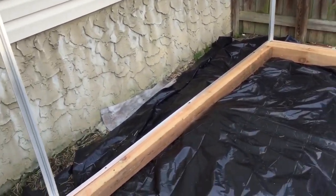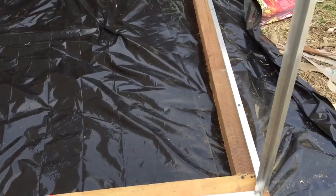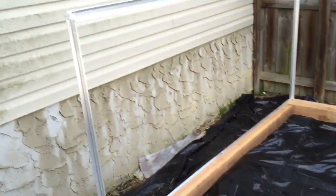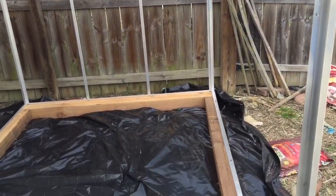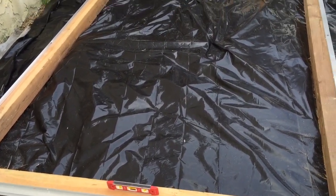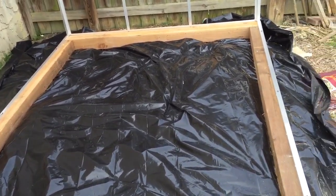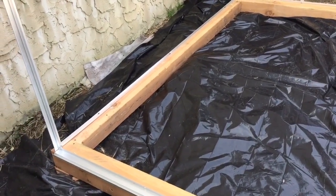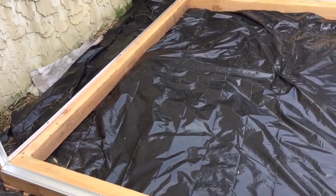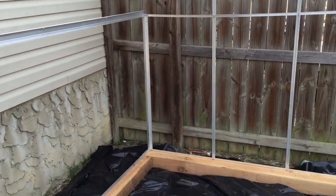We've almost got the base leveled out — just a little more shim work to do. We've got our sides braced, back support in place, and the four corners screwed down. One thing to note: the instructions told us how to build the form, so we followed them and even trimmed it a bit undersized so the framing would lip over it. But when we started fitting it together the metal frame was still too big. So watch the instructions on this stuff — it's always good to dry-fit ahead of time before committing.